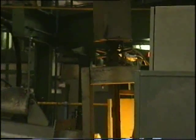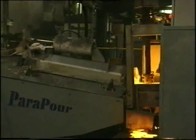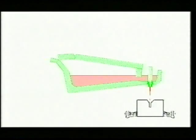This is difficult to see in practice, so let's look at this principle using a diagram which exaggerates the movement. We start with a full bath. Notice that the nozzle is to the left of the mould line. As we begin pouring, see how the body moves to keep the metal stream in the pour cup. With the unit half empty the nozzle is directly over the pour cup.